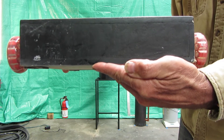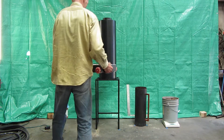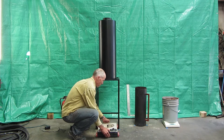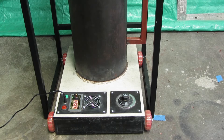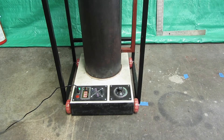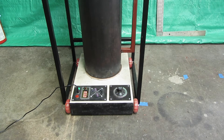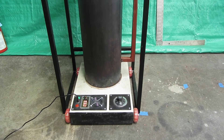The box is roughly 16 by 12 by 3 inches. In this latest version, we have mounted roller blade wheels to make loading safer and easier. The controller uses a thermostat which shuts the unit off when it has finished burning. This also triggers a buzzer that is silenced with a switch, resetting the circuit. The small knob allows the user to increase or decrease the fan speed, which allows for some changes to be made in burn time and intensity.